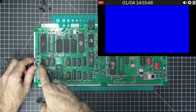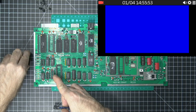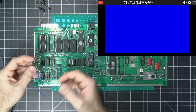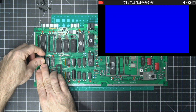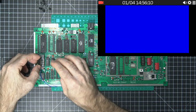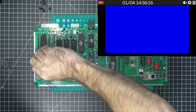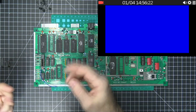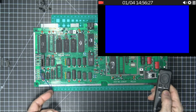What I did is use the 7406, which is right here, because it conveniently has a reset line going to it — which is one of the things we need — and it also has VCC and ground, which the PIC needs. As far as the 7406 is concerned, it doesn't care, because for it this is just a pass-through. We're just borrowing from the signals and the power going to it — it doesn't even know any of this other stuff exists.